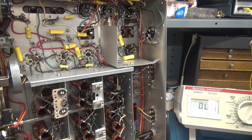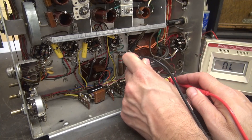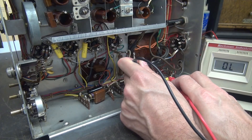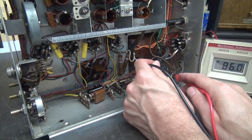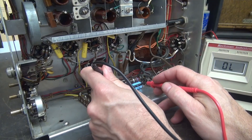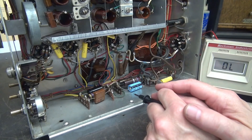Pretty much I'm changing all of them. Let's go down and take a look at the power supply area. Down here looks like we've got a 2.2K — 3.3K. Behind it is another 47K — 86K. Here is a 270 ohm — 315 ohms. So every resistor in this thing is out of tolerance. You have to go through and replace all the resistors as well as all these caps if you want to bring this radio back up to the state of performance you're hoping for. You can't just throw in caps and say the resistors are close enough, because they're not.